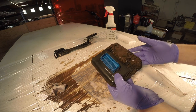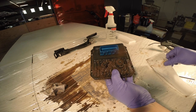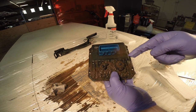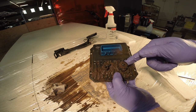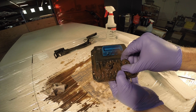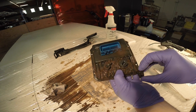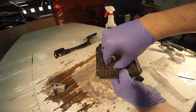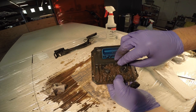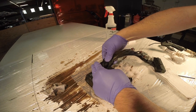The Infinity has two USB connectors that are IP67 rated, which is an ingress protection marking. Level 6 means it's entirely dustproof, and Level 7 liquid ingress means it can be submerged in water up to one meter without water intruding on the connector. Open them up here and you can see that they're clean. The little one's for PC communications; the large one is for logging to an external drive. These are easier to clean, but to protect the plug connector, we're installing the harness back on.